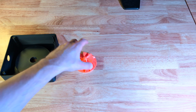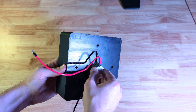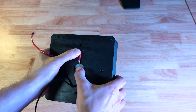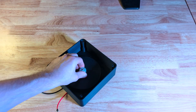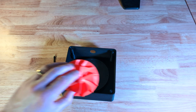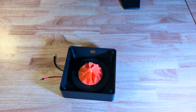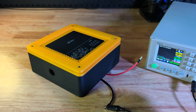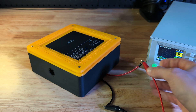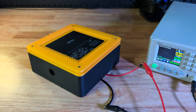Here we go. I cleaned up the parts and they're ready to assemble. I already wired the larger of the two available motors and pushed it into the housing. The impeller just press-fits on the shaft for now, and on goes the teapot with some heat-set inserts and screws. Ready for the first test — setting the power supply to the motor's rated 4.5 volts and giving it a try.